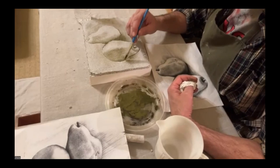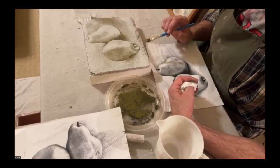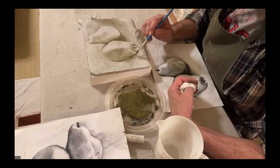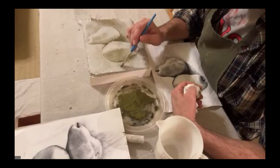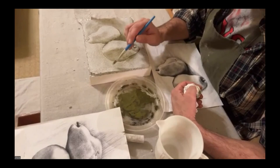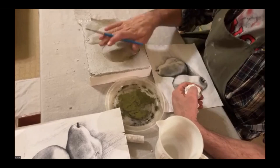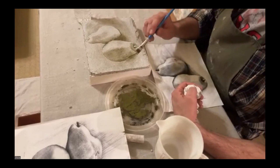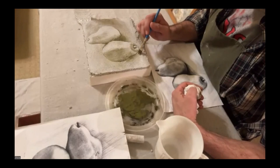The one thing that was different from what I'm showing you tonight: for the base coat, I used this kind of plaster mixed with masonry sand. But when I actually did the intonaco, I used what's called dolomite sand. Anybody who's ever done ceramics might know it. It's like flour, it's so fine. Depending on what kind of sand you mix your lime with, you'll get an entirely different kind of plaster. Mixed with river sand or masonry sand, you get a slight graininess with a nice bit of tooth, sort of like working on cold press paper. Your brush still glides over it, but it has tooth.